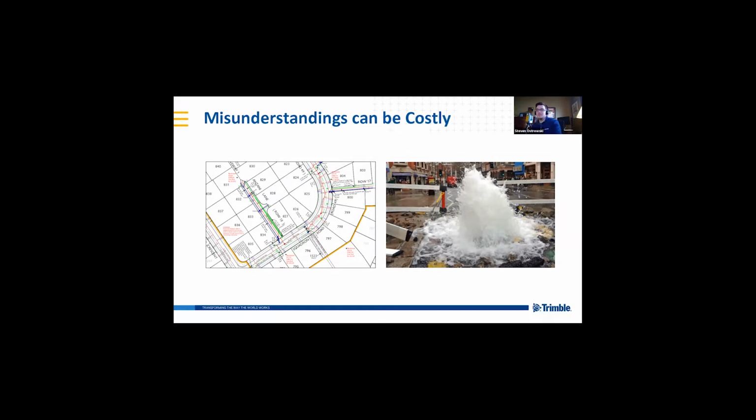Like you see here, if you know where your underground piping or fiber lines are, if you're working on a data center, you can make sure you're not going to miss them pretty quickly and easily with your AR and MR devices. And if you are close to them, we would tell you to probably take out some of those more traditional surveying methods, your total station or scanner, to make sure that if it's less than an inch, you probably want to check that a little bit more.